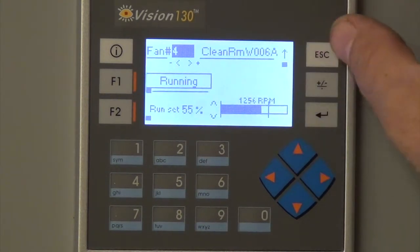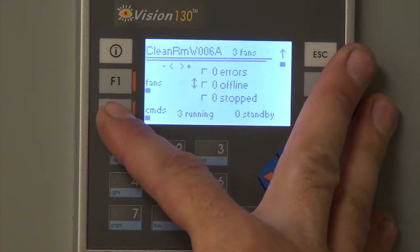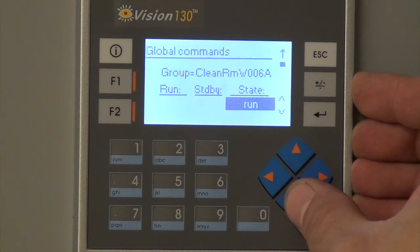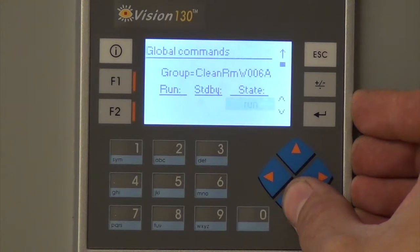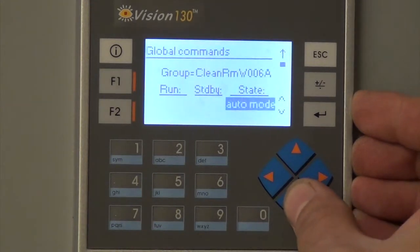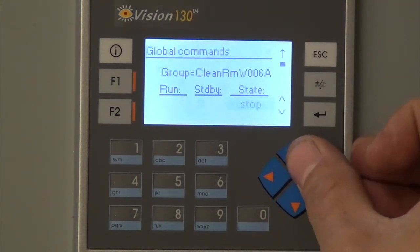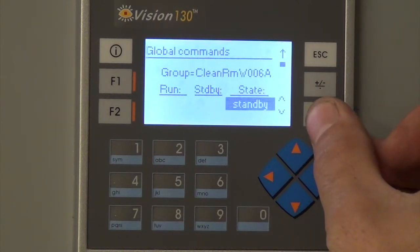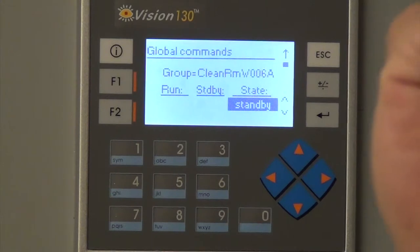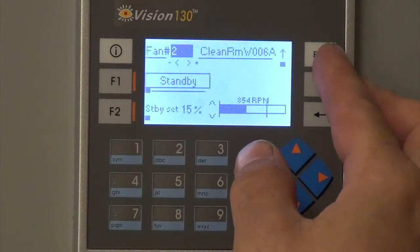This is all based on balancing of the system and making sure that we get the supply air into the room and the differential pressure across the doors. So when they actually start up, they should start with the back room. Work forward. No, wait, if you're starting from zero, just command them all on. Okay. And then the balancing of the system will get the airflow into that space and across the doors as required. Command them all on, is it also command on?